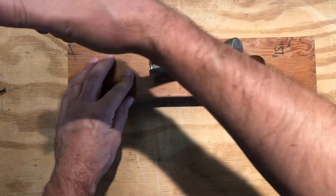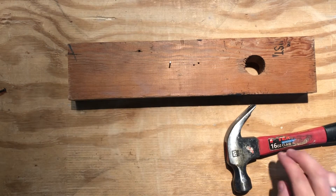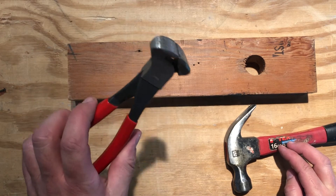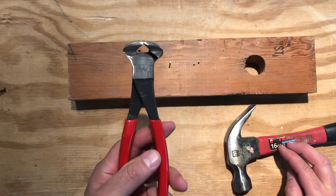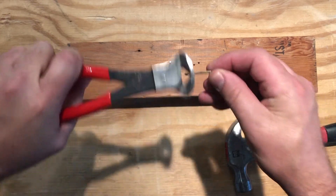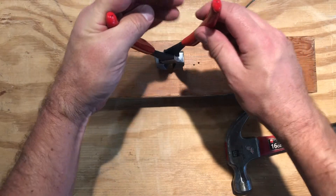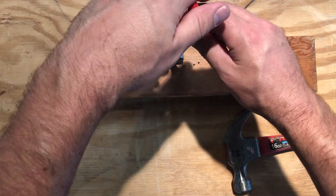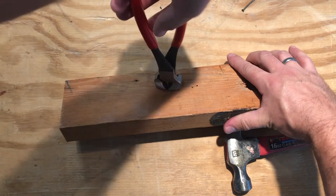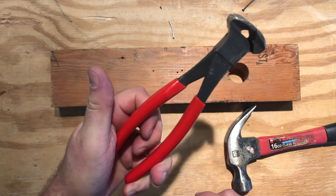This one might work, it might not. If you have a thinner nail and the hammer's not cutting it and you can't pull it out, then you can use these. These are called end cut pliers — they're called that because they cut the end of things. You can also use these to pull a nail. This is even good for a nail that has lost its head. You grab it right by the base and then you just roll it, and it rolls the nail right out of there. End cut pliers.